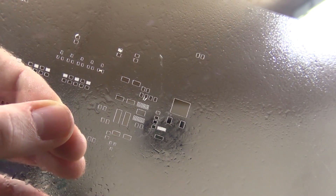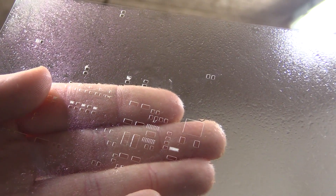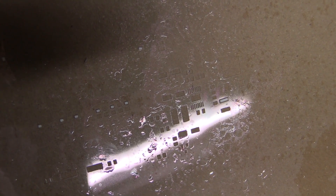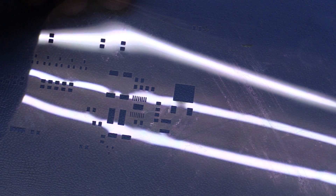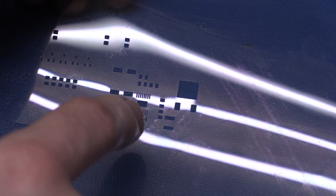If we remove the paper you can see that there's still some space between them. It is nice and sharp. After I punched out all the small pieces of plastic and washed it with water, there are no raised surfaces on the edges at all. You can see even the pins on the SSOP package are cut nicely. I'm not sure how small you can make them because this is my first successful one, but at least an SSOP works nicely.